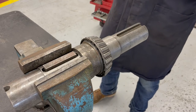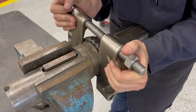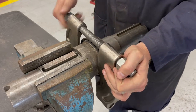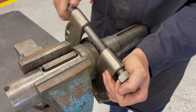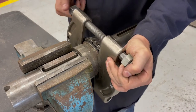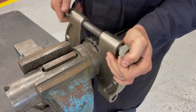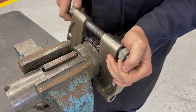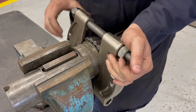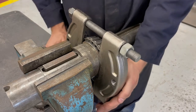And what I'm applying right now is called a split bearing puller. So these two halves are put in behind. You can see there's a little notch where it's going to fit on the shaft, and as I tighten it up here, these fine-threaded nuts are high tensile grade 8 steel, and then in the side of the split hub bearing there's a couple of threaded holes where I'm going to attach a couple of high tensile rods to pull that bearing off the shaft.